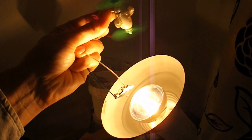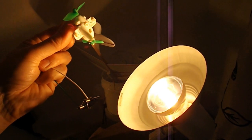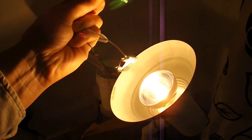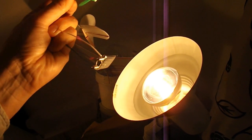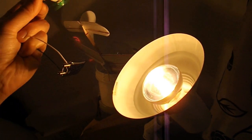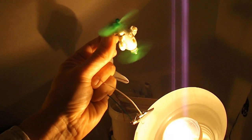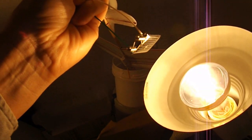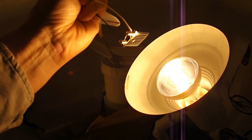So that's my next suggestion. Make sure that you're using the right type of bulb to supply the power. So say if you live somewhere where it's a bright sun outside, then fine, go outside and try the sun. If it's a slightly overcast day, it may not work. Solar cells don't give a lot of power, so if there's anything wrong with your electric motor, or if you haven't made the right connection with the wires, if you've left the insulation on, then you may find the solar cell's absolutely fine and it's a problem with your wiring or your motor.